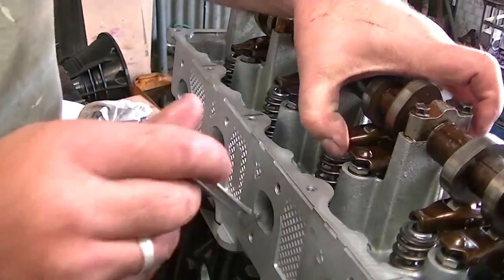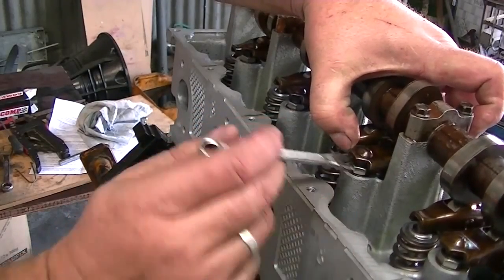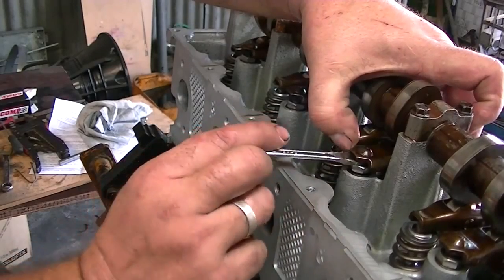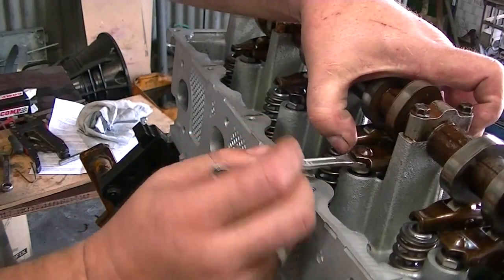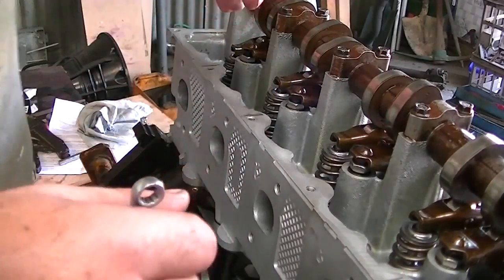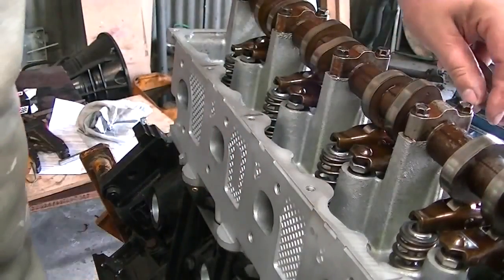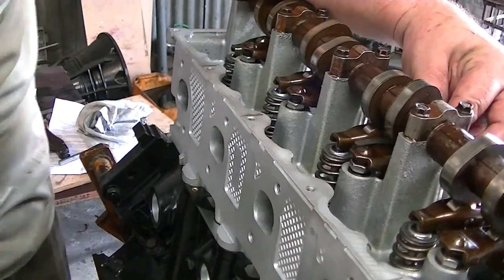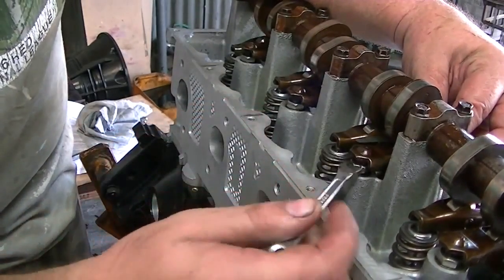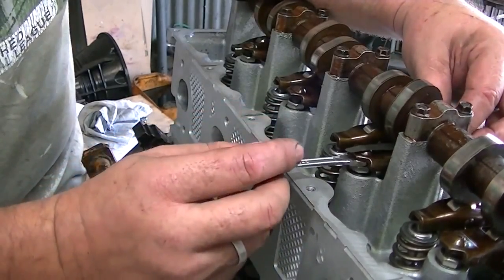So the first thing I do is bring that gap a bit closer. This is a hit-and-miss method but I found it a lot easier — you just have to have patience and time. Okay, that's touching now. I'll get my minimum clearance feeler gauge in metric, which is 0.05 millimeter, and I tighten or loosen until I've got it in there nice.